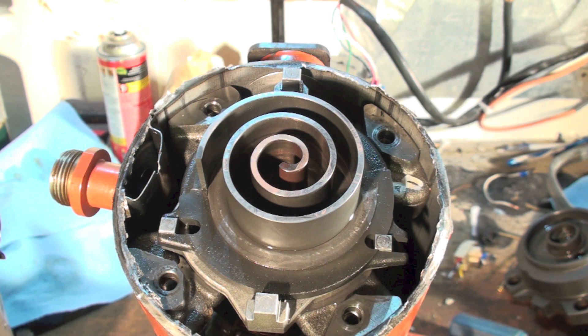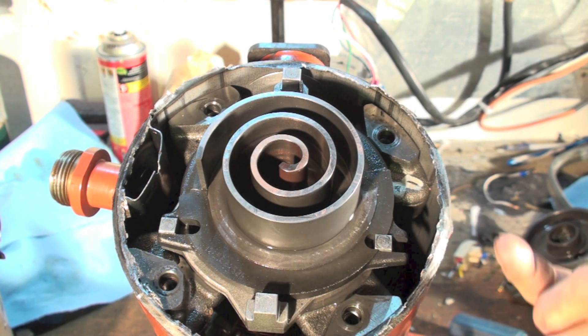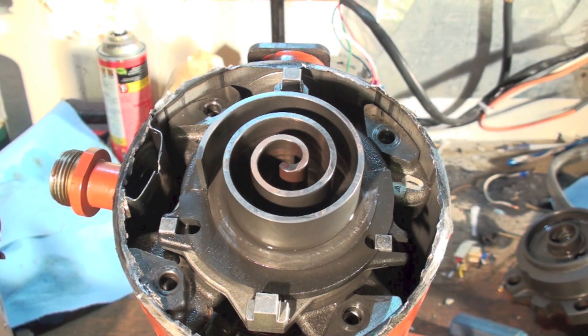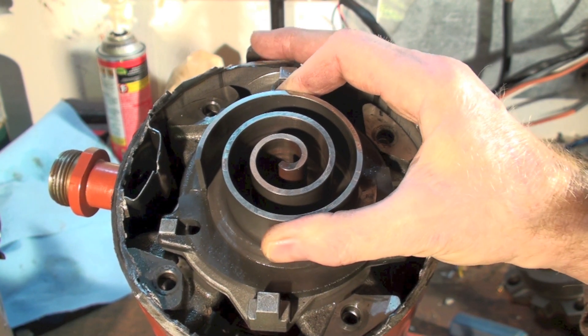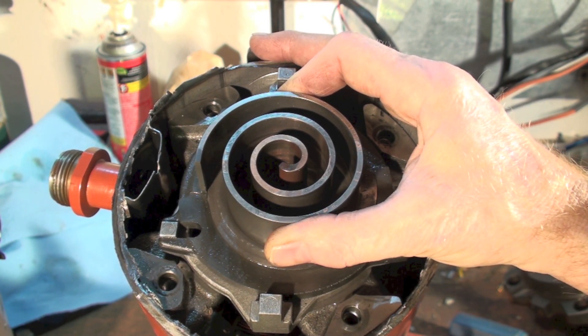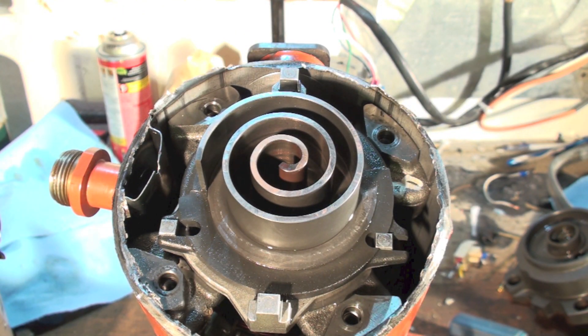These things do require a lot of lubrication. If you look at them running with the oil sump in the bottom, there's a fog coming out when you start it up because the oil pump pumps a lot of oil up into the scrolls and moves it through and out into the system and back again. It's simple but complex — that axial movement is what saves these things from destroying themselves, though service techs can destroy anything given the chance.